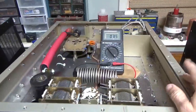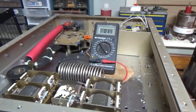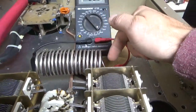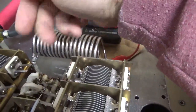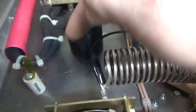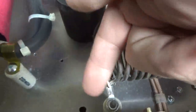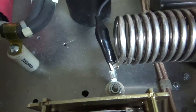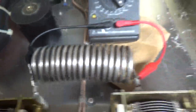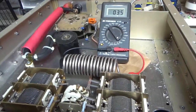I'm waiting on a part arriving today to complete the AL80A, so I'm going to do some work on the 6,000 amp. The coil is about 3.5 microhenries. I'm going to add some straps between each end of the coil and capacitors. But first I'm going to mount the mica caps. I bought the hardware. I have to plug up that hole down there — I want to get this cap as close to the capacitor over here as possible, so I can't put a screw through it; it'll interfere with the bottom of this capacitor. I'm going to use one of those hole plug thingies, make it larger, then plug it. Then I'll cut some straps. I'll show it as I go along.